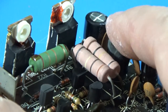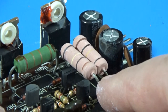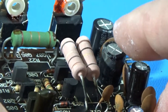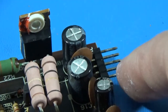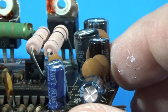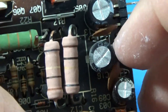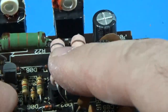There's an electrolyte in here — it's kind of a gel. Once it starts to dry out, the series resistance of the capacitor goes up. Once that happens it gets hotter, dries out more, gets hotter — thermal runaway — eventually it will pop. Normally the vent on top — that's what this little X on top is for — is that if the pressure builds too much it would pop. Is that my imagination or is it bulged out a little bit? Could just be the shadow. We'll put the tester on this capacitor, and probably a couple others nearby since they probably got hot too.